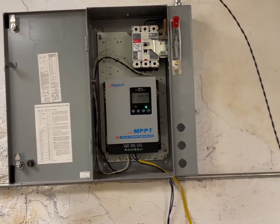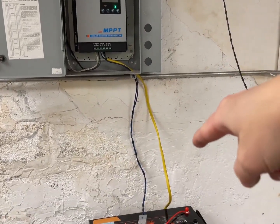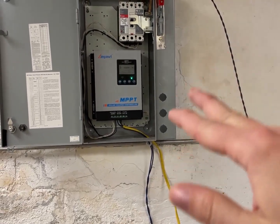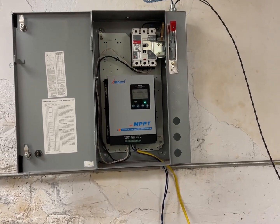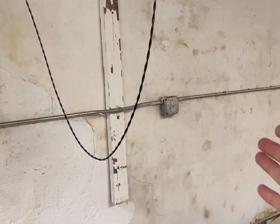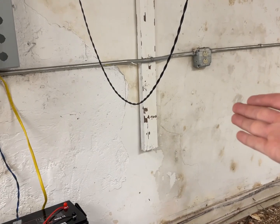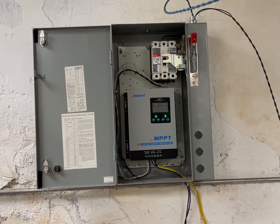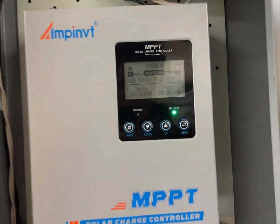What I should probably do is have a small 30 watt panel connected directly to the outputs. That way the system can get itself going if there is sunlight but the BMS of the battery is off. In the end, probably what I'm going to do is have one dedicated system and then have some buck converters or whatever to move that power into batteries that I want to take somewhere else, such as the apartment. By the way, we should be hitting 90 kilowatt hours pretty soon.